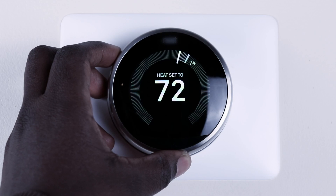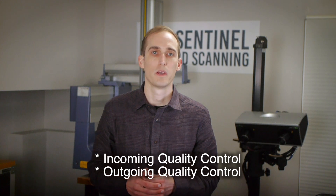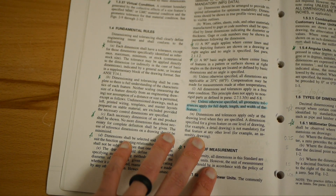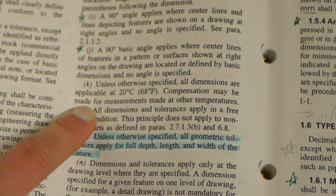One of the first things you should consider when starting a new lab is the temperature of your lab space. Materials expand and shrink as a function of temperature — when temperature gets warmer, parts expand; when it gets cooler, parts shrink. So it's important that all labs, IQC and OQC for instance, measure parts at the same temperature. According to ASME Y14.5, unless otherwise specified on the drawing, parts should be measured at 20 degrees Celsius or 68 degrees Fahrenheit.